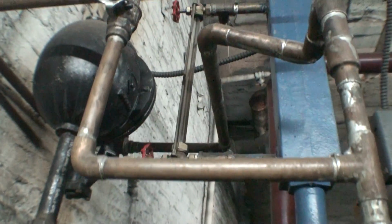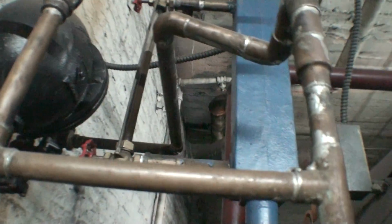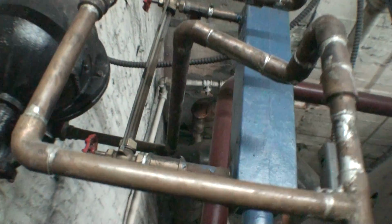This is currently piped into my drainage system, which takes the water back to a sump pump pit, and the sump pump disperses the water into the sewer. Now, normally I tend to do this about 3 good times to establish that the water comes back inside of this sight glass clean, or cleaner than what it normally would if you did it just once.